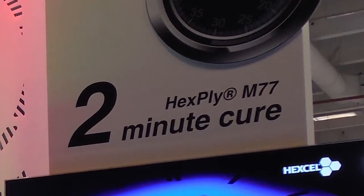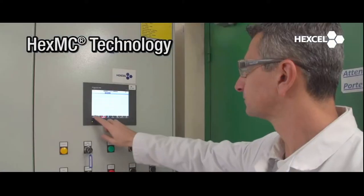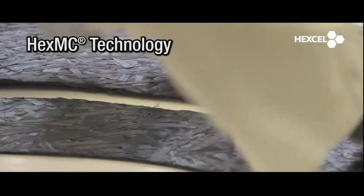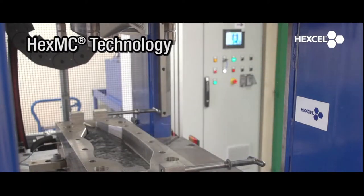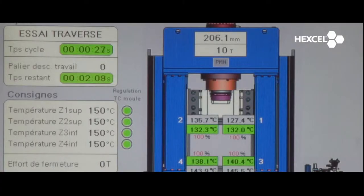M77 was designed to combine all advantages of the solvent-based resin systems used in industry. We now have a highly toughened resin system specially designed for fast-curing processes. You can cure within a very short time at high temperatures — up to 130–160 degrees in as little as two minutes. It's a very fast system providing very good parts in a very short time, speeding up the whole customer process. It's suitable for all pressing processes including compound pressing.